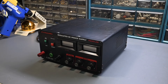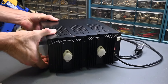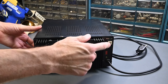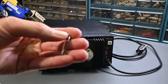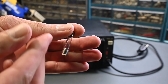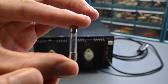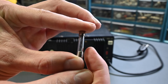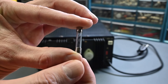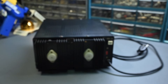The first place to start looking is the fuse. I unplugged the power supply. On the back there is a fuse holder — you push a little tab down and it pops out — and there's a 3 amp fuse inside. The fuse was in fact blown. You can see a break in the fine wire element inside; that's the fusible link. It's blown completely open.